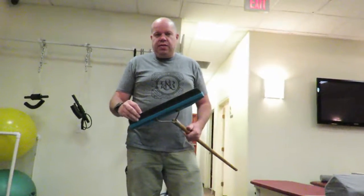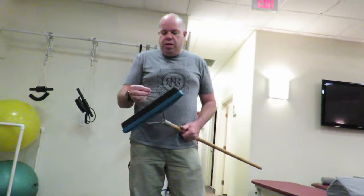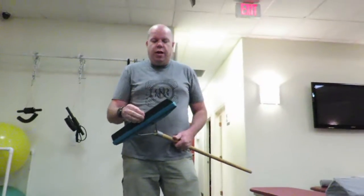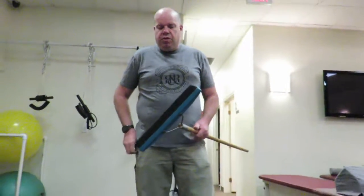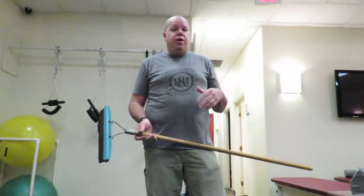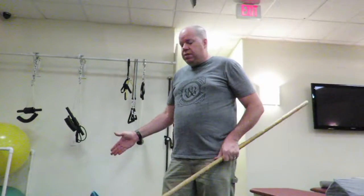It is the last thing you do as you finish the job of carpet. So you'll want to do this within 20 minutes of finishing an area, because once the carpet starts to dry, you're not going to have a good result. The wet carpet actually, just like working with your hair after a shower, it's easier to comb and groom when it's wet. So this carpet does not need to be brushed.